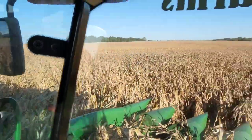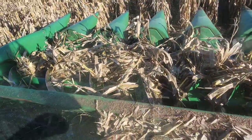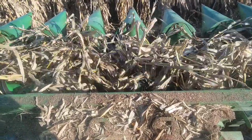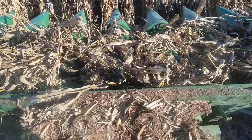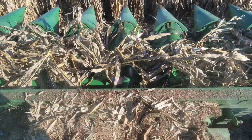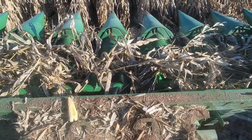I got into a spot in the corn where the tops are more broken out of it, and I started bringing a bunch of material in and we plugged up our auger. So we've got to reverse it, run it backwards a little bit, and then we'll kind of bump it and see if we can get some of this stuff to feed through without me having to get out there. See how that auger stops turning.